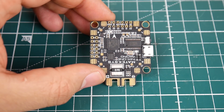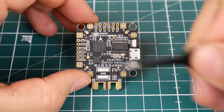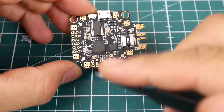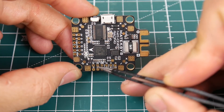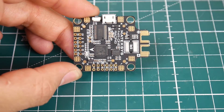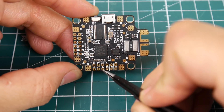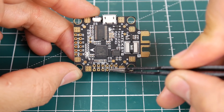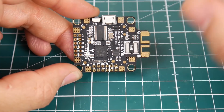Keep in mind you're limited to FrSky protocol radios or universal ones like the Jumper. The motor orientation is correct, it's an F4 flight controller using the MPU-6000 gyro, which is the gyro we all love. Starting from this side: we have ground, ground, 5V, 5V, LED, and buzzer. The LED pad takes 5V and ground, with the signal pin telling it what color to be. The buzzer pad takes 5V positive with the negative on the control side. We also have T2/R2 (UART2) and T1/R1 (UART1), ground and 5V.